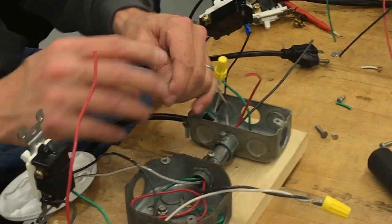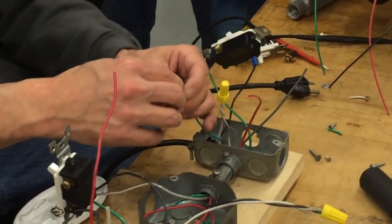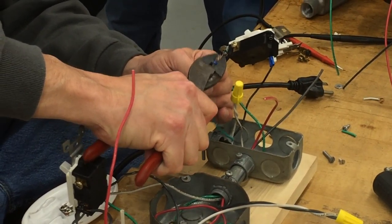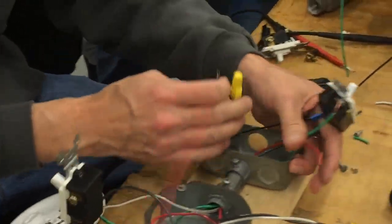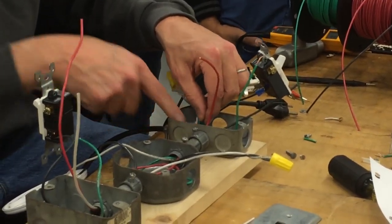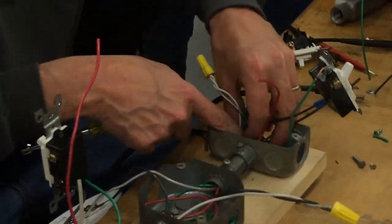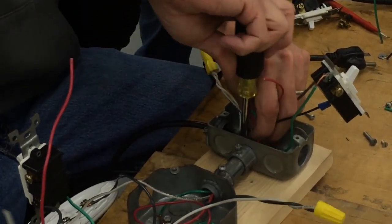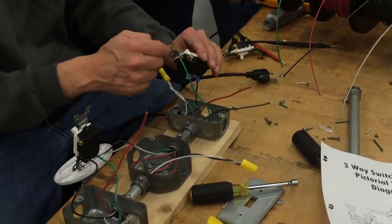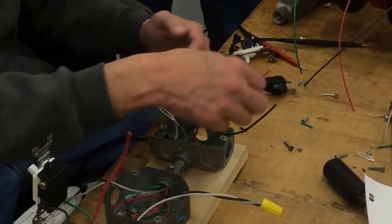I'm going to go ahead and do my ground real quick. We can make it all one piece and make a hook and just attach it, but I'm going to use the spade terminal — the fork. Lock it in, crimp it down. Then I can loosen up that screw on the bottom, slide it right underneath the screw head, and that'll be grounded. So now I've just got about everything done — all that's left is a red and a white over here, and a black and a red over here. It doesn't matter what color — once you get the commons taken care of, then the traveler wires don't matter which side they go on.